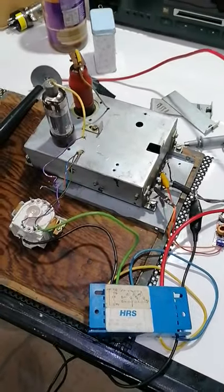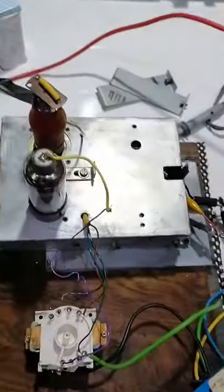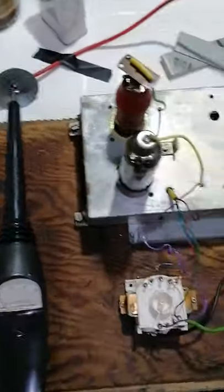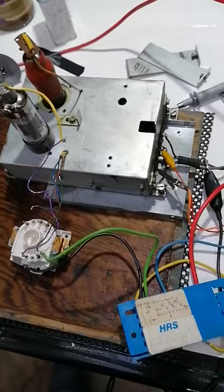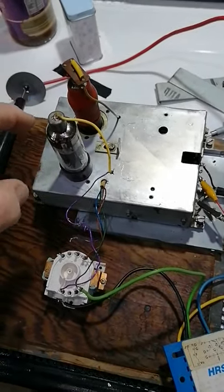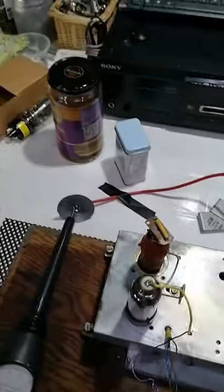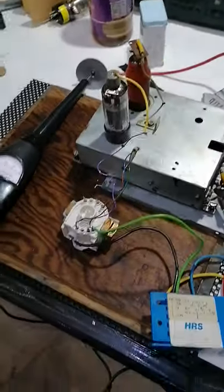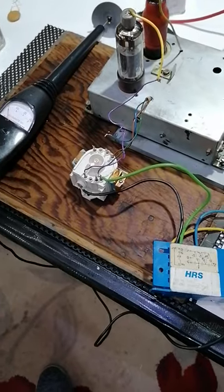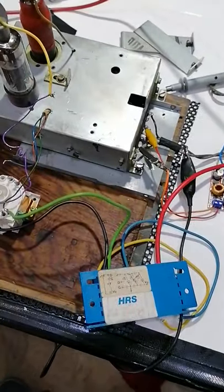I was really surprised that the jelly pot works. In fact, I've even got a 3000 EHT transformer and it works as well. The only difference is you get quite a fair bit of pulse on the anode, which is why I'm using the EL36 — it's spare, and if it gets wasted, fair enough. I don't want to ruin an EL38. It does operate with the EL38 fine. So that is today's progress, if you want to call it progress. Thanks, guys. Bye.